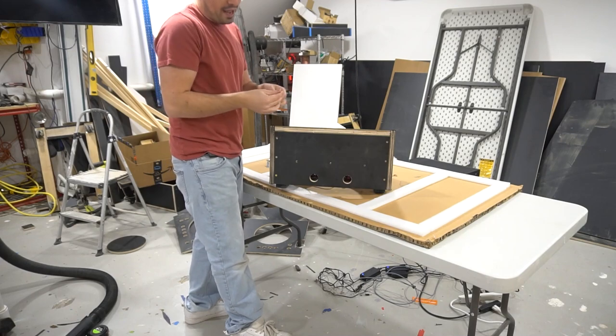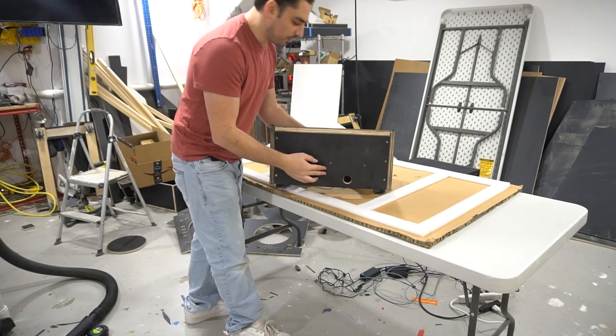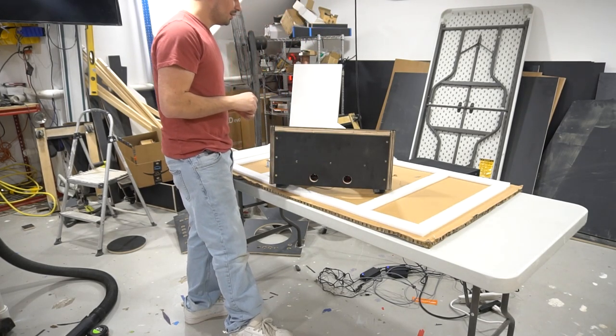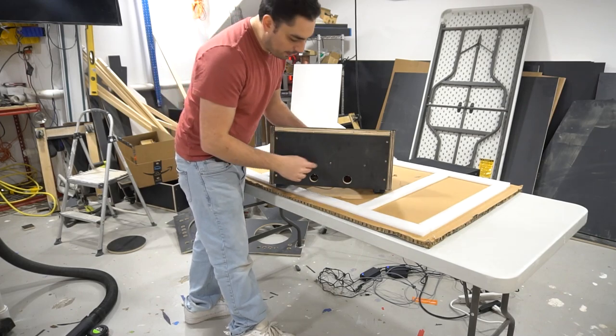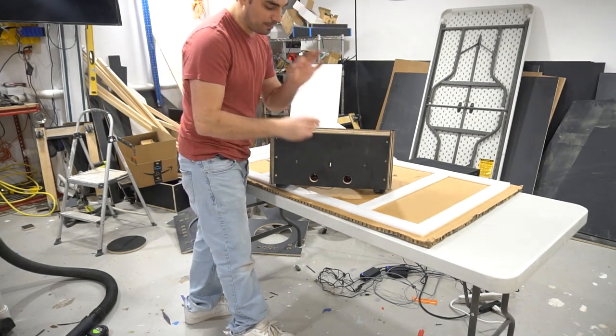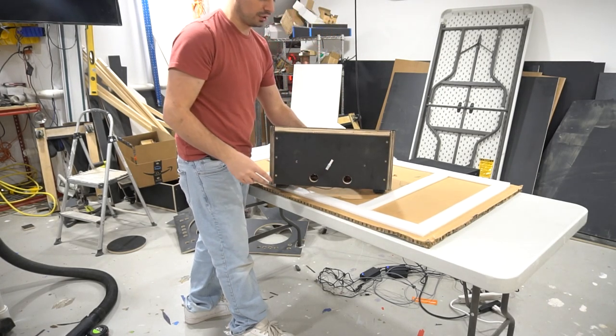My way is really just getting a small screwdriver. Basically, once you mount it, you're gonna put the screwdriver in the hole and just make a marking on the wall. If you look carefully, the hole here for the screw, I did it this tight. It's not a big hole like this. This way, the toggle bolt stays in position.